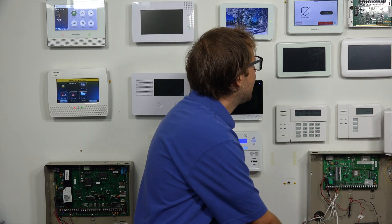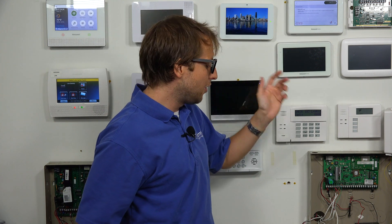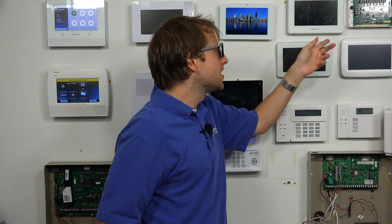We have our transformer here and we're going to unplug it. Now we have an AC loss condition on the system. If you have trouble reaching the transformer, you could instead cut power at the circuit breaker, or if you have a Honeywell LT cable, you could undo the barrel connection. We have cut power to the blue terminal block that you'll see when I open up the panel. Now we're going to switch to a Phillips head and undo the set screw at the bottom of the panel so we can take it off the backplate.